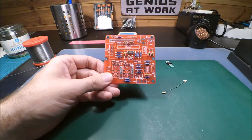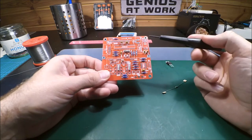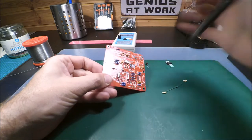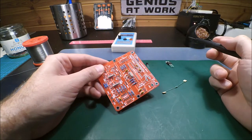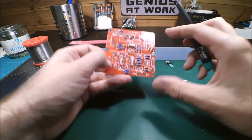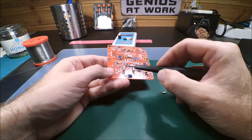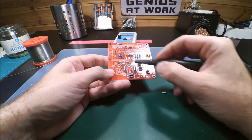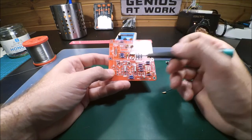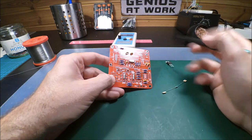I've made some progress. The resistors are in place. We have a 22 microfarad capacitor and a 104 — that's 100 nanofarad. These polyester capacitors go next to the relays and small diodes. For the diodes, make sure to turn them in the right direction — there's a marking on the PCB that matches the small line on the diode.